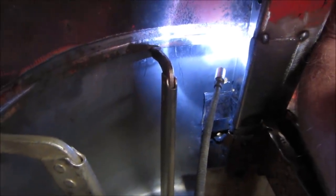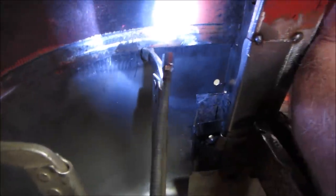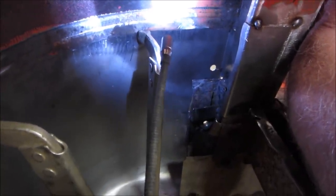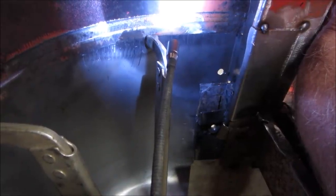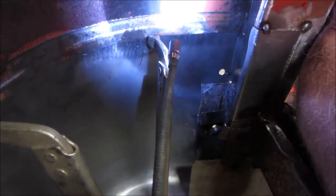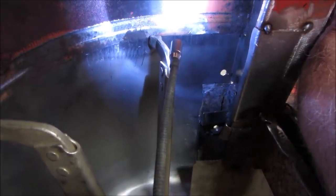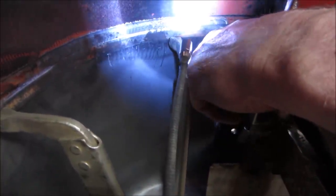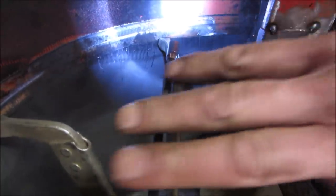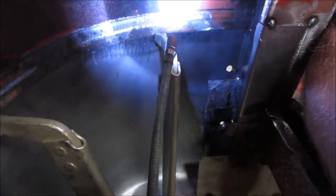Well, I think our best bet is to take a piece of metal, probably about 4 inches tall and maybe an inch and a half wide, wherever that width is down there. We'll make it an inch and a half wide, 16 gauge. We'll put it behind there where we'd like it, then mark it from the back side with the drill bit again or a Sharpie. And we'll drill a hole through it, weld a nut on it, then put it back on, bolt it together with the bracket. And we could probably get a couple tacks on this one and a couple tacks on here. I don't want to attach it to this yet. I want to let that float for a little bit. So maybe if we can remove this, and when we do the floor section, I'm not sure yet. I just don't want to commit to welding that yet. That's all. Let's go see how that works out for us.